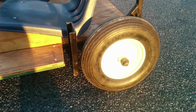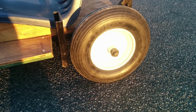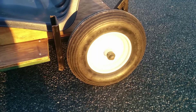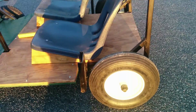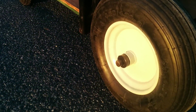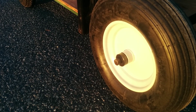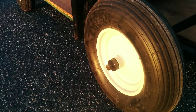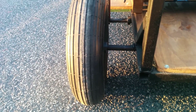The back ones are 15.5-inch by Universal — these are a nylon base wheel. The fronts are rubber. Nylon wears quicker; we did have nylons on the front but they wore out a lot quicker for turning, so we switched to rubber in the front. These are just wheelbarrow wheels. You can see on the end of the shaft — the three-quarter inch shaft — there's a locking collar that locks with a screw. We use these around a lot of the chassis, on the inside and outside. We have about a four-inch extension.